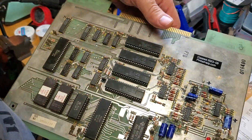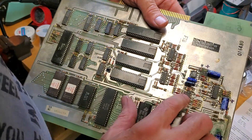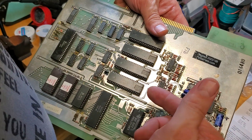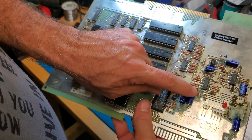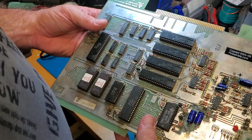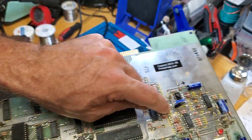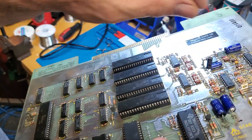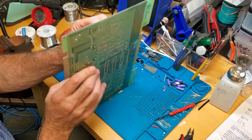Always make note of the orientation of the capacitors — they'll have positive and negative sides. On polarized electrolytic capacitors the little indentation side is positive and there's also an arrow pointing to negative. There's no rhyme or reason to orientation on a board — here's one where positive is this way and the one next to it has positive the other way. Never assume they're all symmetrical; it's very rare when they are.